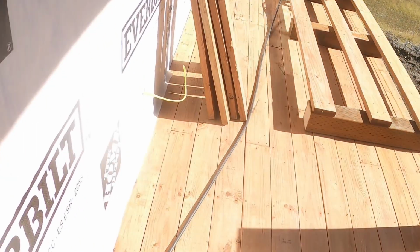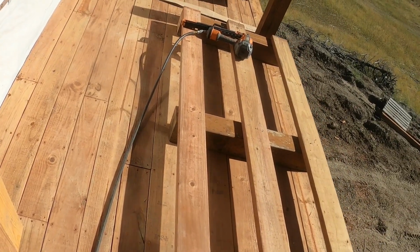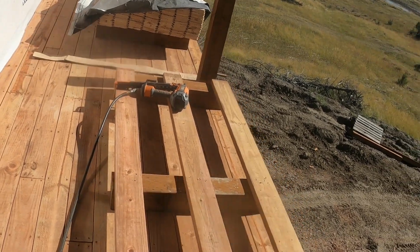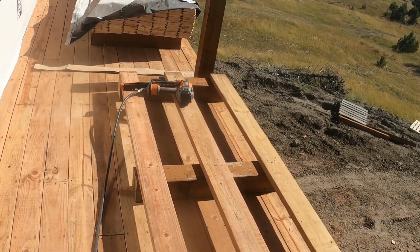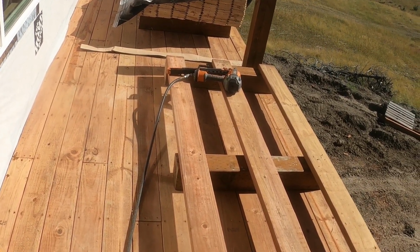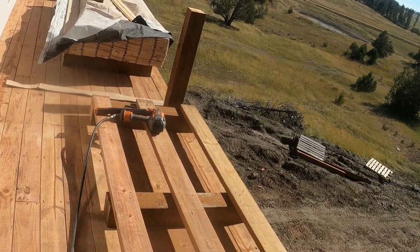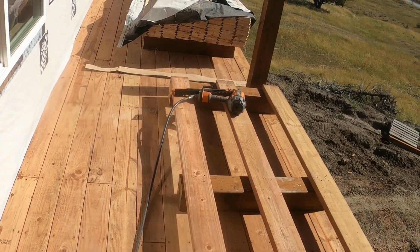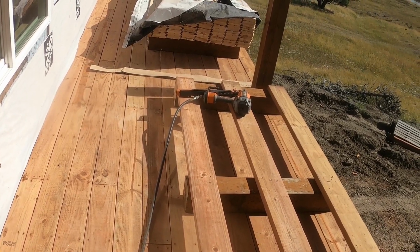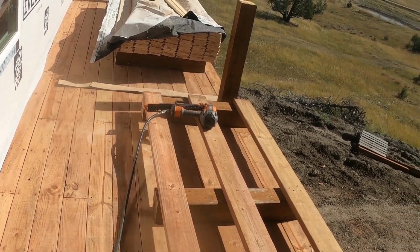So anyway, what we're going to do here is we're going to put uprights on each end corresponding with the boards. We're going to put cross pieces left to right. We're going to put 2 8-footers on top to tie it together, and then we're going to put corner braces on, and that will give us a wood rack that will hold, let's see, cords 4x4x8. This is 4x4x4, so this is a half a cord when this is full.